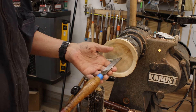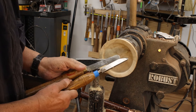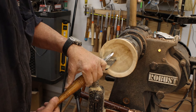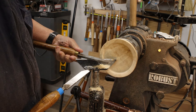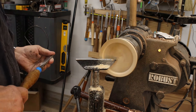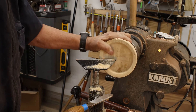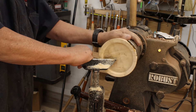This is basically the same tool — these are very, very old Robert Sorby tools I've had for many years. Here is my traditional scraper that I've been using. Now here is a negative rake scraper — there's the bottom bevel, there's the top bevel. The traditional scraper can be a little bit harder to control, but the negative rake scraper you will find is a dream to use. Let's go around this transition right here — and that works really well. I'm getting a fairly nice surface. This bowl is pretty much practice — anyway, you get the idea, I've got a lot of scrapers.